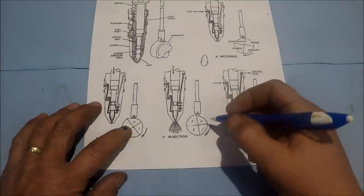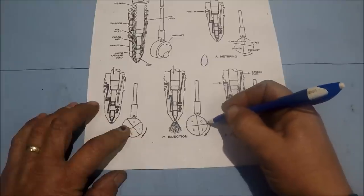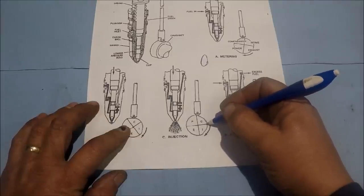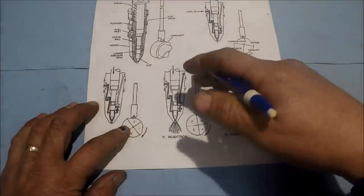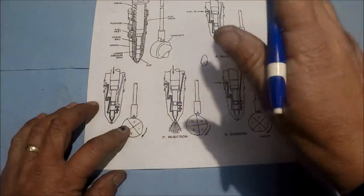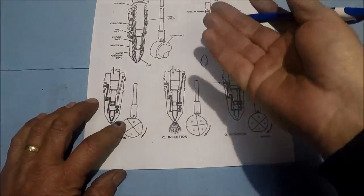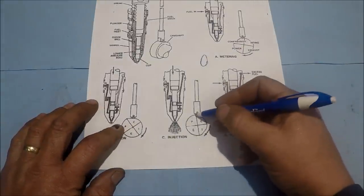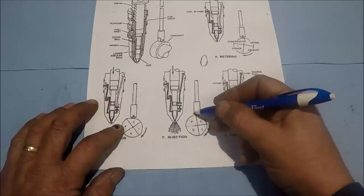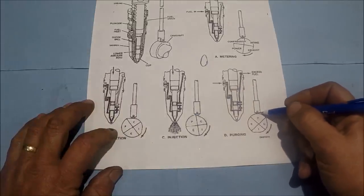Of course, there's a little bit of a ramp from the small one to the big one. But basically, when you're talking about inner base circle, you're talking about the low point on the cam, which would also be when the injector is all the way up or open, when the pushrod tube, or the top of the rocker arm, would be up. When we talk about outer base circle, that's when this roller is sitting on, more like right here,